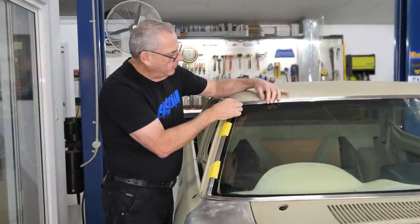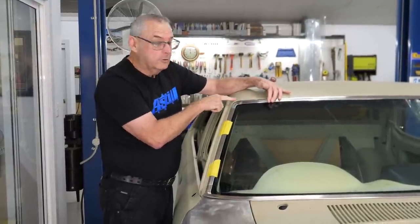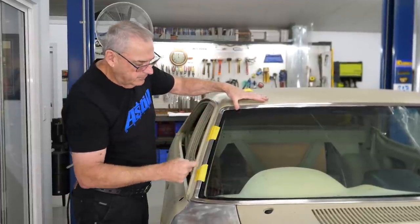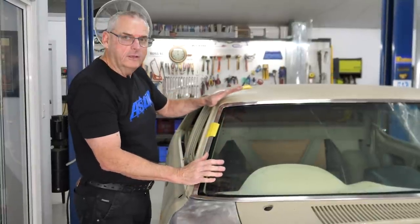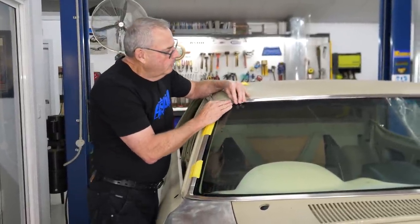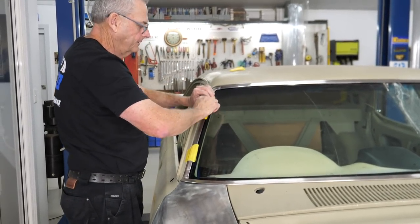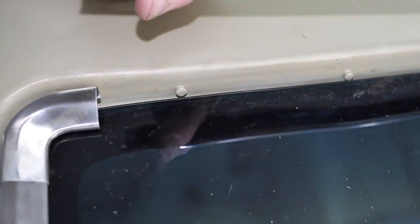The other thing I'm chasing is how far I've got to have it off the steel with the urethane when they put the dam on there to get this height, so that this fits nice and we've got no gap to the glass. All of that setup is important so that when your windscreen guy comes you know what you want him to do - otherwise if he puts it in too high or too low these aren't going to fit. This one was sort of close - we've given it a bit of work but it probably wants just a little bit more because it's still sitting out a tiny bit from the body, so we need a little more curvature through here. This one slides on and off and that little radius there - depending on how far you have the car back this still has the factory lead in it - you can add more lead, a bit of bog, or weld the steel up to get that radius.